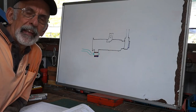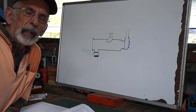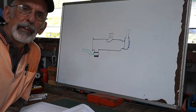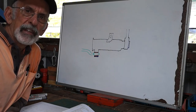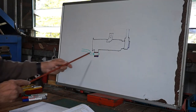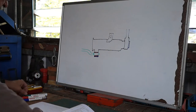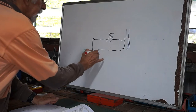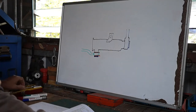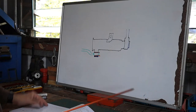Alright, I put it all back together and filled it up with oil as you've seen and left it overnight. When I had a look this morning there's a tiny oil leak that I've introduced by pulling everything apart — I'll show you where it is and what I've done hopefully to rectify it. The oil leak is from here where the hollow bolt goes in. I'm not quite sure if it's coming out of that union there or that union there or both. I tightened that bolt up quite a bit and had to stop — I thought I was going to break something.